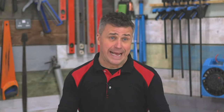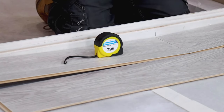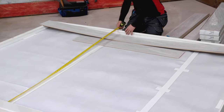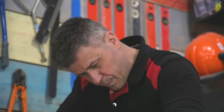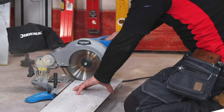Once you're satisfied with the layout of the width of your room and the size cuts, you've also got to work out the actual length. You must work out that when you go the full length, the end cut must be more than 50 millimeters — that's the manufacturer's recommendation. The way mine works out, I'm going to have eight full boards and then my cut will be around 70 to 100 millimeters, minus the expansion gap on both ends. Planks are easy to cut with a hand saw, but a circular saw or chop saw will make installation quicker.